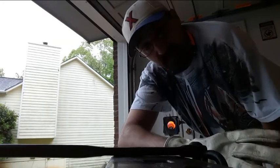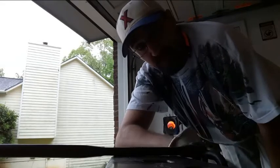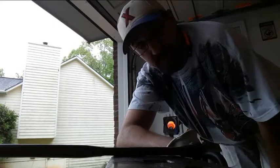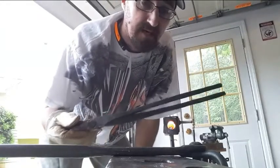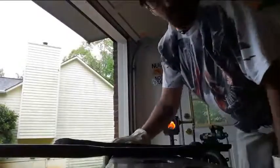But if you're new and you've got railroad spikes, or you can get them, learning how to turn them into square stock will give you a great practice material and a great raw material for making a lot of knife blade projects. I said I was able to draw these out of two railroad spikes just by turning them into square stock. And being able to flatten that head out makes it really, really convenient. So I think I'm going to try working from this side. If I work from here, I think you'll get a better view. That's what I'm going to do.